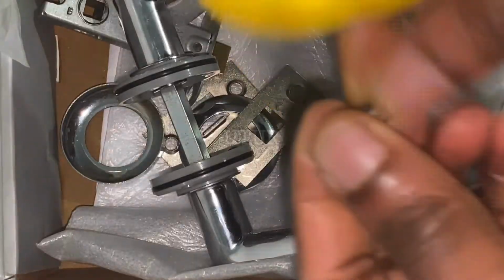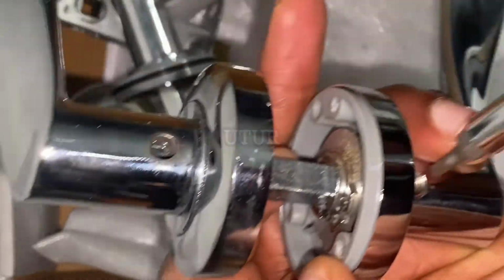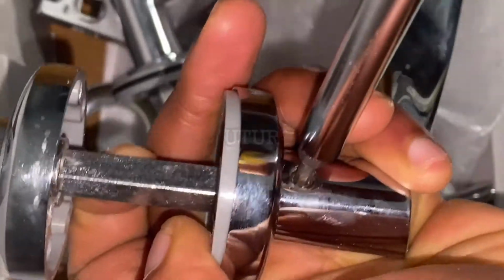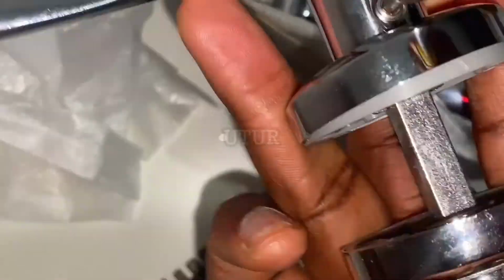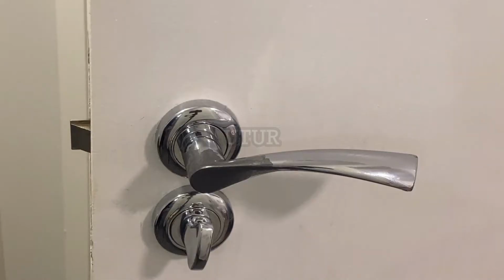If your spare has a hex screw, to get it out, just get a hex screw bit, which is the H3 here. Put that into your magnetic bit holder and try and undo the hex screw, which is screwed on to the bar that you see here. Sometimes you might have your handles without the hex screw fitted, and that's because the thumb turn provides an impediment or obstacle towards fitting in the hex bolt. So sometimes you don't get them installed, but if you do have them installed, by all means get it out with a H3 hex screw bit.